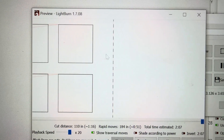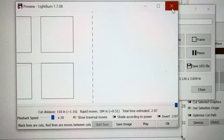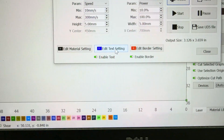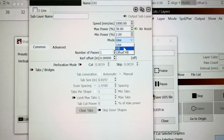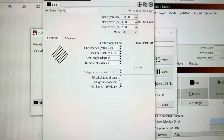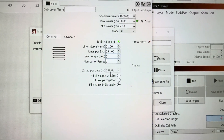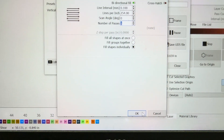In order to make sure this is working how the user is expecting, we're going to go in and change these things. The text looks fine, it's filling fine. But for the material settings, we need to go in and change this to fill. We're also going to turn crosshatch off because he's on a CO2, so we really want it just to go left to right. We'll leave the angle at zero — left to right on those fills.